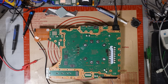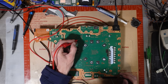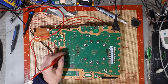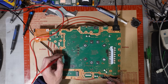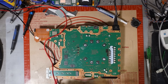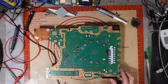So this is board number 10 — could be 10 or 11 — of the 15 boards I bought. We have a 5 volt rail, a 3.3, another 5, another 3.3, another 5. We're going to get a 0.8 volt rail, a 2.5 volt, 12 volt, 1.1. But no 5 volt here, and no 5 volt there. When we power the console on, we're supposed to get a 5 volt rail just down here and that's not enabling, so let's find out why.